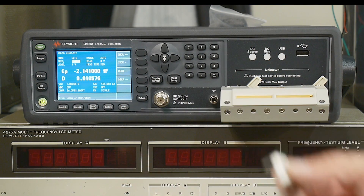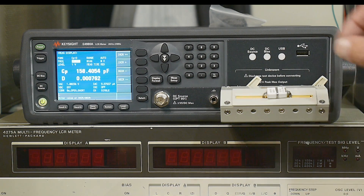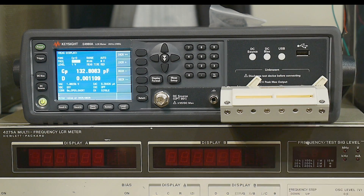I have these little guys here — these are half a percent. This one is 158, this one is 325 — very nice. And this one is 180. So all of these capacitors I'm showing here, I'm going to create as secondary standards. I'm going to measure them under careful conditions and write all these down, and these will become my standards that I'm going to use.